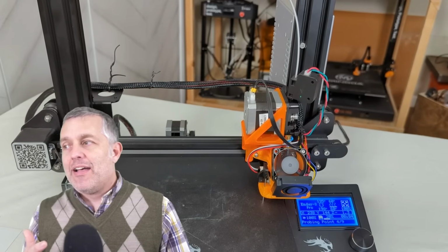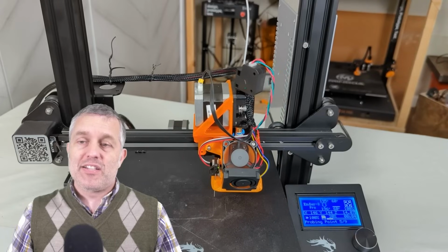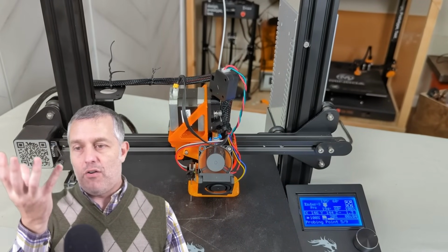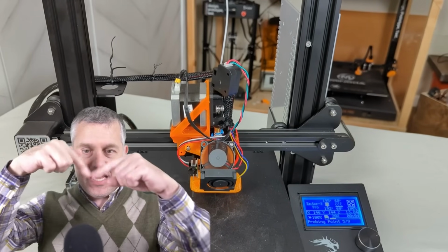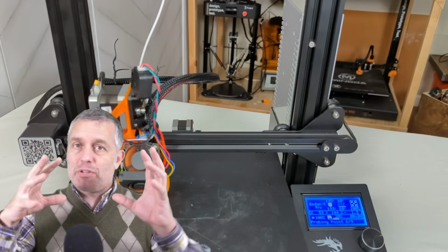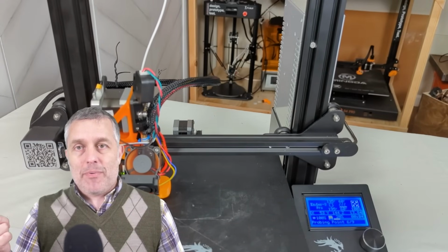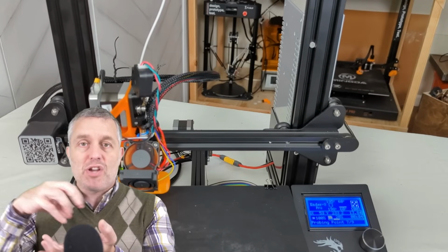But there's a drawback. You can't measure your bed with a cold nozzle, because there's a possibility that you have some hardened and dried old filament from the last print that's kind of like a little bubble hanging out of the tip of the nozzle. Or even worse, maybe you have a bunch of buildup on the nozzle. So then you heat the nozzle up, but you have a bunch of buildup on the nozzle. Even when heated up, it's still soft and squishy.